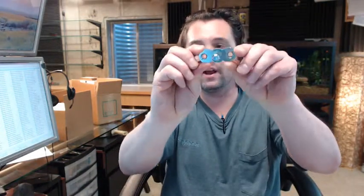So step 2 is mortising and, quite frankly, just attaching the top pivot. And at that point, you're done. Put the portion in the header, put the door portion in, and you're in good shape. You're going to want to mortise that cleanly. You will see a little bit of it if the door is held open at 90 degrees. You're going to see part of that staring down at you.